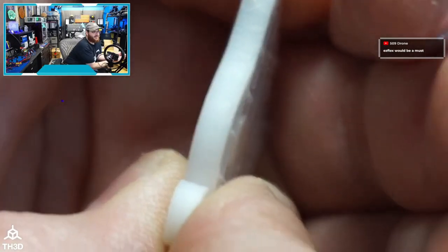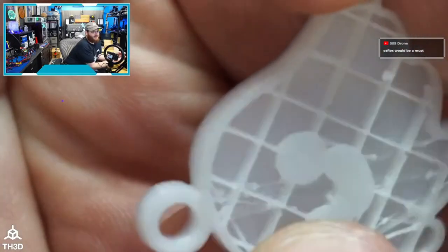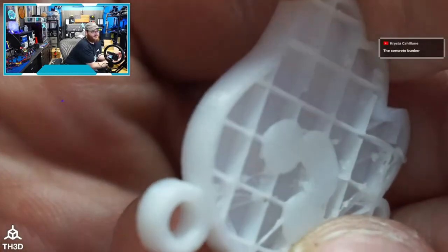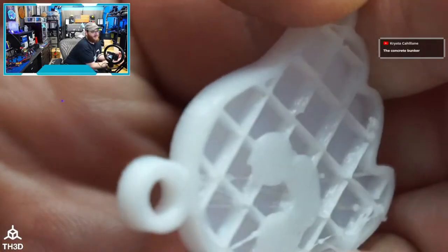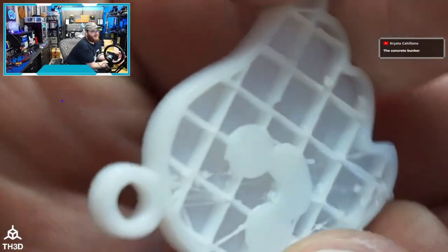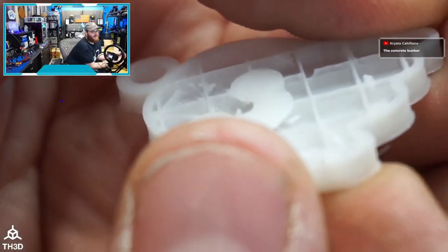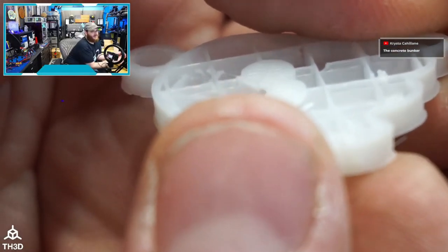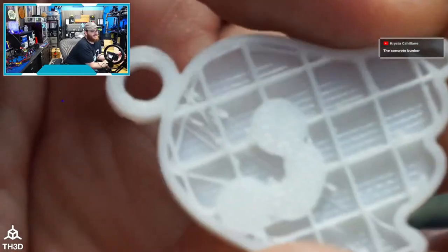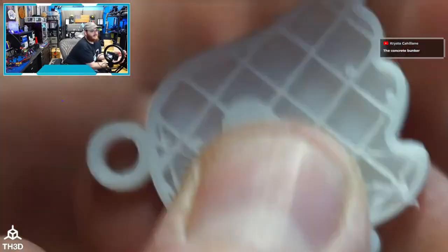Print quality looks really good. We did speed it up, and you can obviously see some retractions aren't dialed in, and infill got a little weaker when I cranked the speed to 130%. So this extruder isn't going to do great at high speeds. But at the stock settings it's actually doing pretty good — the infill feels solid. Just your average decent print; it's what I would expect, on par with other machines.